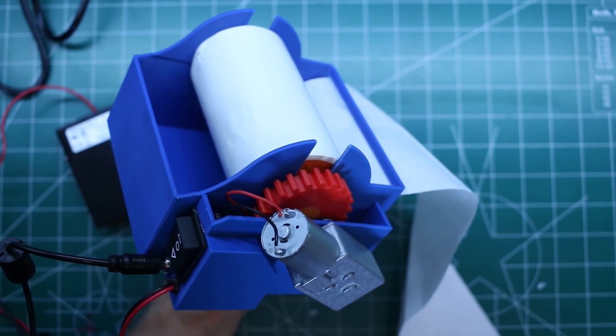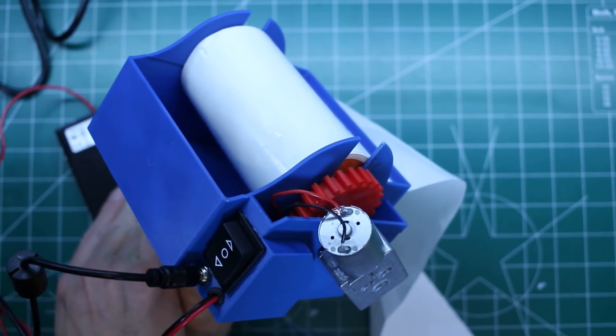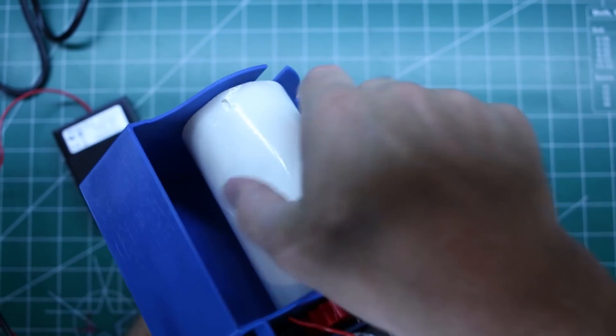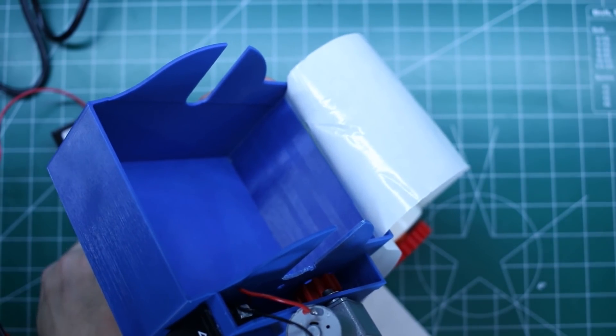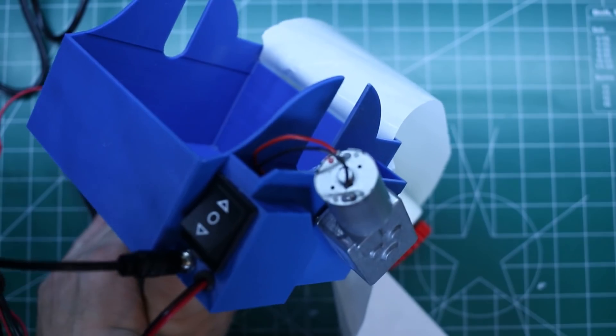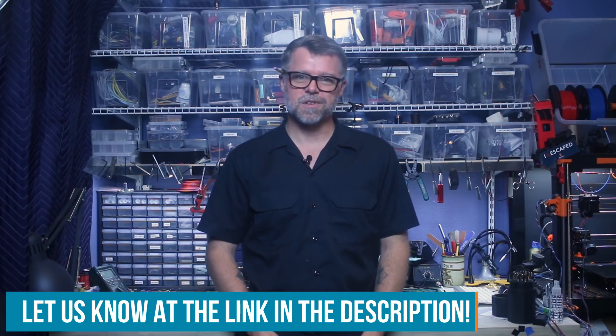Then she said there's smoke coming out of it and it stopped. I started digging through it and the motor burned out. The wiring is fine — I think this is just a bad motor. You can see it starts to go and then there's a little flash of bad stuff — and it doesn't go. It's not under excessive load either. This motor was rated for much higher load than we'd ever put on it, so I'm going to have to replace this motor — I probably should have bought one from Newark. That's all we have for today. If I'd had more time I probably would have put in a speed control circuit, but to fit it in that small space would have required a custom PCB. How would you have approached the solution to rolling up labels? Let us know in the Element 14 community at element14.com/presents. See you next time.